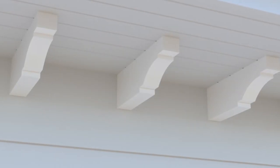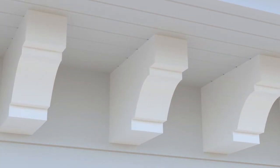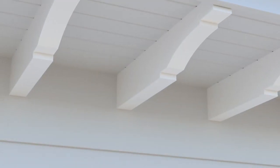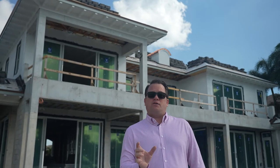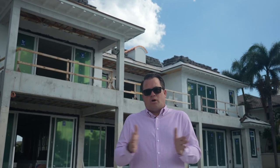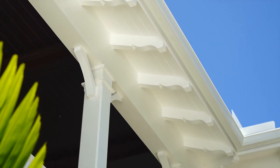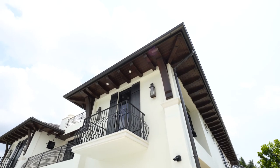So it looks appropriate to the scale of the home, and the scale of the timber makes sense with the spacing, because the spacing should be determined by the size of your rafter tail. You don't want a bunch of three and a half by five and a half inch rafter tails at 16 on center — it will look crazy. When you want close spacing, you want to get to a two inch rafter tail. When you want to spread out your spacing, you want a larger rafter tail.